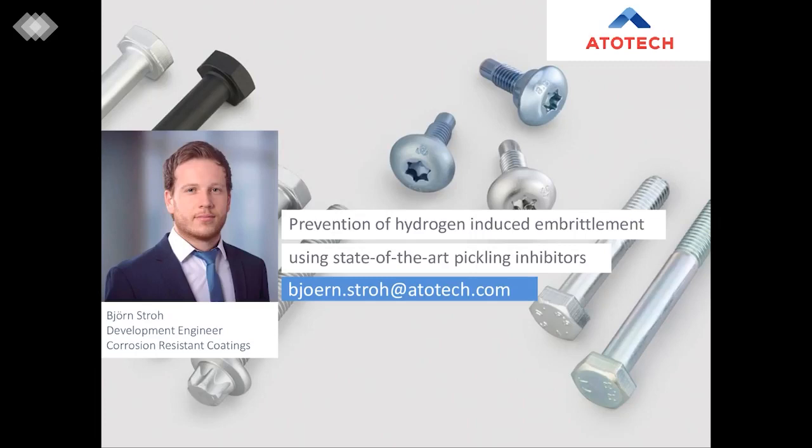Thank you. There is another question. Is the inhibitor compatible with other pickling additives, such as wetter or accelerator? Yes. So, in general, these different products are compatible. However, you have to be aware that when, for example, you add a compound which accelerates the pickling, this does also affect the performance of the inhibition of UniClean 511. But it is mixable.